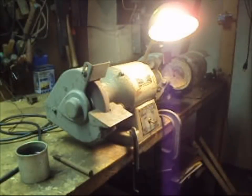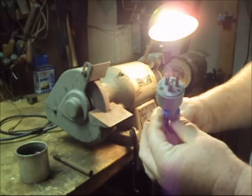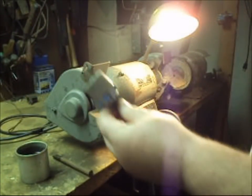Make sure that the grinder is off when you plug it in — you don't want to get caught in it just because it accidentally starts. Now let's plug in the grinder. Make sure it has a three-prong plug and that the outlet is three-prong, because the casing can become energized if it's not grounded.